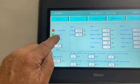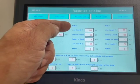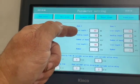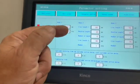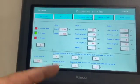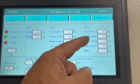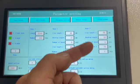Mode 2 is the A-elbow. With the A-elbow, when you set the parameters, your first measurement is the length of the pipe before the first crimp. The second is how long is the distance between the crimps, how many bends or crimps will it make, and how long post-crimp will it run until it cuts off. Mode 3 is the B-elbow mode, which goes 75 millimeters with 22 millimeters in between crimps — and all these can be changed.